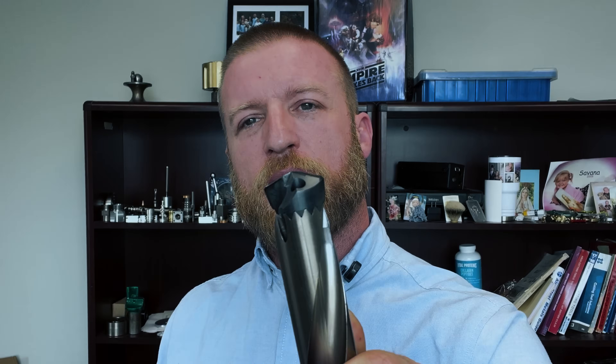Now let's get into the cons. The biggest con is the price — the price on the drill bodies, the drill tips, and especially the way they've gone up over the past few years is outstanding. We've seen price increases of 20 to 40 percent, and I don't think it's just the carbide price — it's the overall price of the tool. Another con is that once that edge wears, you're done, unless you find a good tool grinder that can take them back. With this particular brand we do send them to be reground; they have about a 60 percent refurb rate. However, the height is a little bit different after regrinding, so you're going to have to reteach your tool on Z-zero.